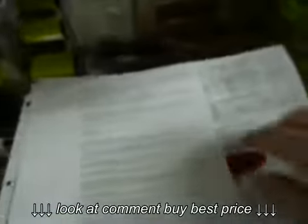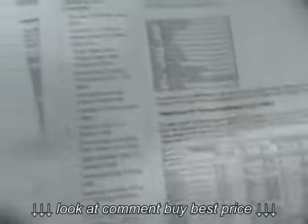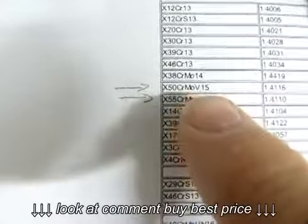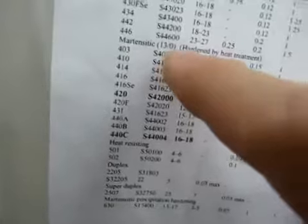But the European steels, take a look at this page here from this website. This is the British Stainless Steel Association, and the numbering system for stainless steels goes a little differently. You can see on the page here the steel X50 CrMo identified there, and that number there and this entire column is yet another steel numbering system. And some other alternative designations are also listed here. These steels that go into the manufacture of Swiss Army knives or other knives as well, they're pretty close to the 420 steels that are called 420 on the other numbering system. And they could also be marketed and marked by 13/0. Okay? So that's how some of these steel designations work.